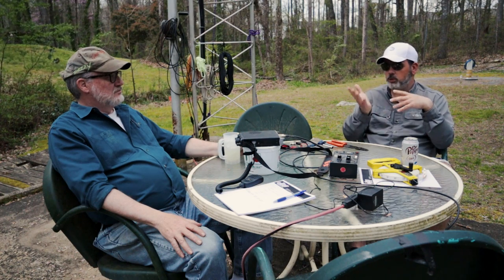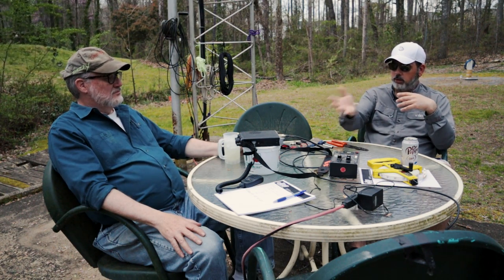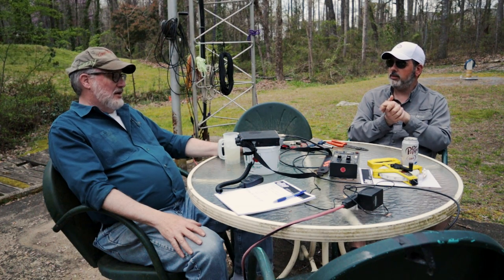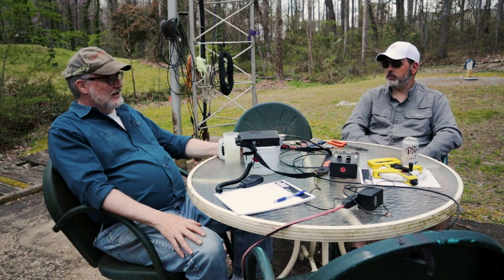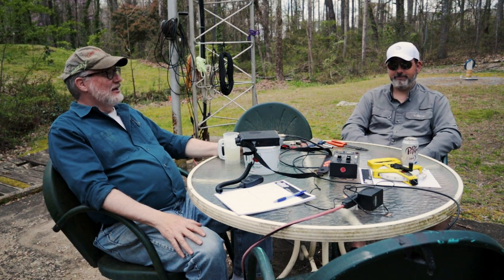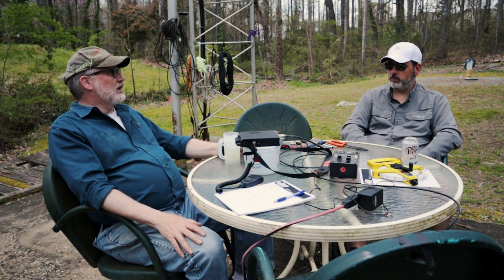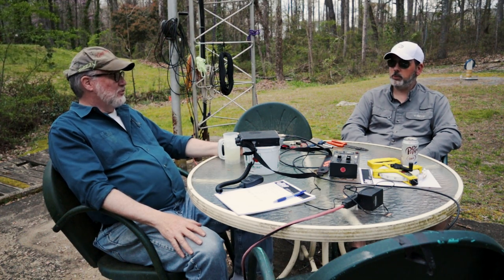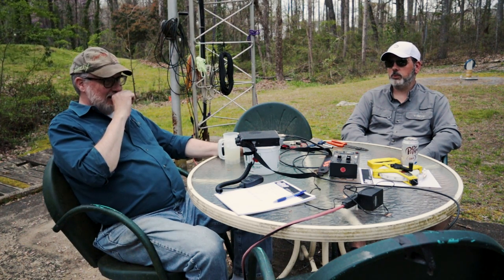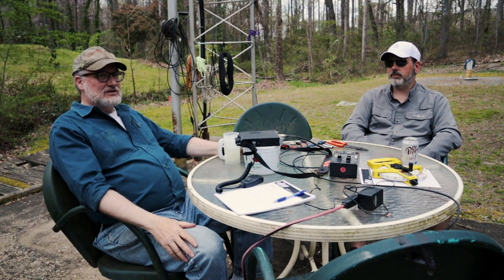But so we built this, strung it up, tested it, made a few Qs with your Yaesu FT-817, and how much power were we running? I'm going to guess about 3 watts, and that's why we struggled a bit on 20 meters, because it's a contest this weekend, and there are folks who have more power and antennas with more gain than we do. Nevertheless, we did make a couple of contacts, and I can't stress enough that this is an antenna that, in a sense, got made out of everyday things.